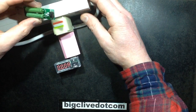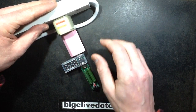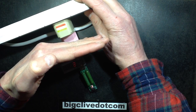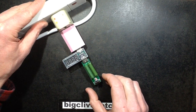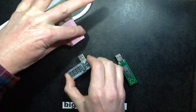Let's plug a 1 amp load in. The voltage is now not readable because it's just jittering and flickering on one of the digits. So it's obviously not rated for 1 amp. What if I put it to 2 amps? Nope — not even the green light comes on. It's not capable of supplying an amp.